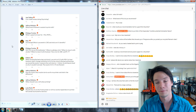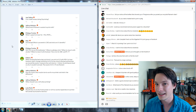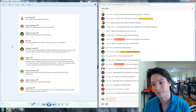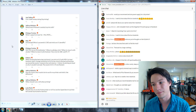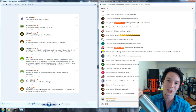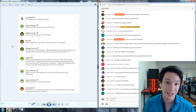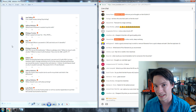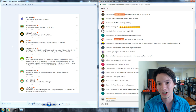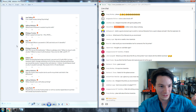What is parametric CAD and what are its benefits? Parametric CAD is different from TinkerCAD because you can go back and change dimensions and things will auto-update. For example, if I designed a bottle — gave it dimensions in a sketch and revolved it — and wanted to make it twice the height, I could go back to my sketch, update those dimensions, and everything down the tool chain updates. That's parametric CAD — parametric computer-aided design. I learned SolidWorks at university and that's just how my mind works. It takes longer to set up the foundation, but once you have it you can easily go back and change things rather than remodeling the whole thing.